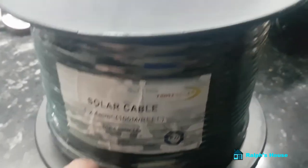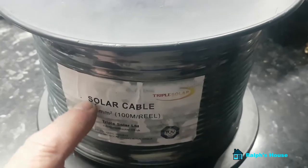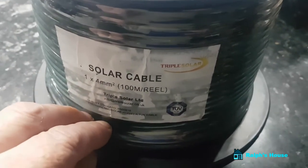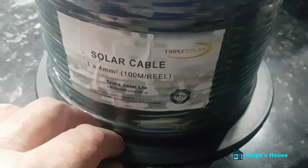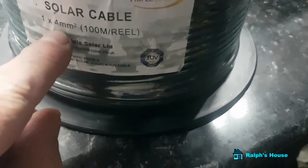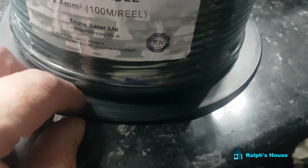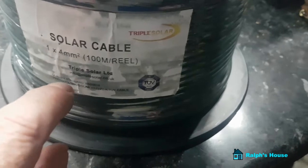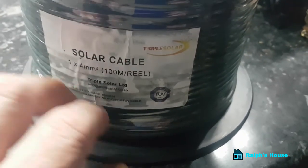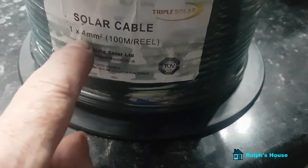It's getting late here at Ralph's house. I've just been about 20 miles to pick up this reel of solar cable. Solar cable isn't cheap and neither is copper at the moment — thick cables or anything will cost you. A lot of people with excess cable tend to give it to scrap merchants and you just can't get it — it's almost worth its weight in gold. Anyway, I've got a 100-metre reel of this 4mm stuff — that's the cross section of the copper, it's quite chunky. Great for solar panels, especially where you've got a bit of a run because you get voltage drop — the thicker the cable the better. You're looking at between £95 and £125 for a reel of this stuff, but it was unused and I got it for £40, so I consider that a bargain.